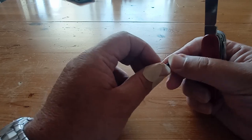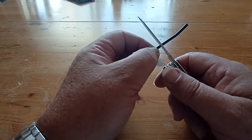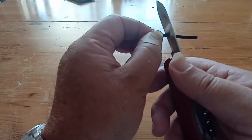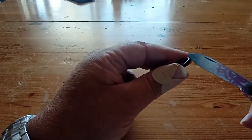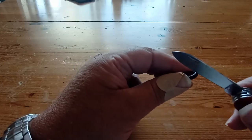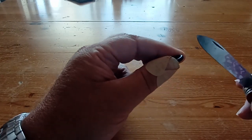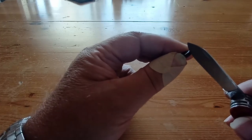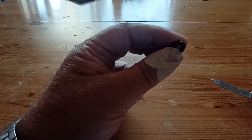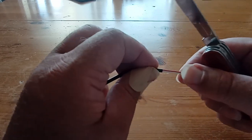Fortunately the two bits of cable inside are different colors. Now I'm going to strip this back quite a way because I want to have a bit of a gap. I'm going to use what I call the ring mark method, where you make a little notch in the plastic, and just work that very gently — because I don't want to damage the insulation underneath, but I do want to get to the separate wires. Just very gently, using absolutely no force, just the sawing action.